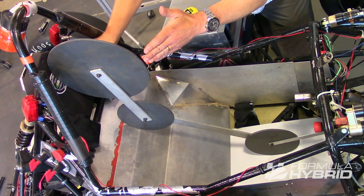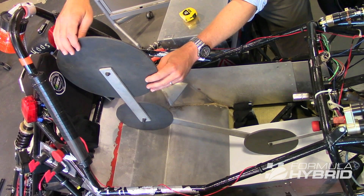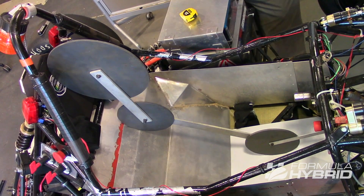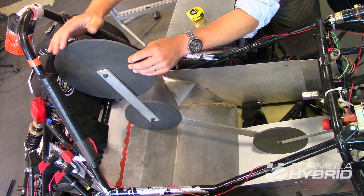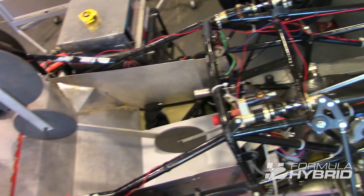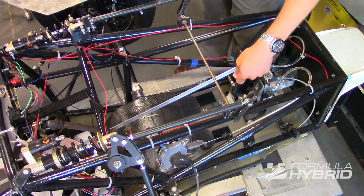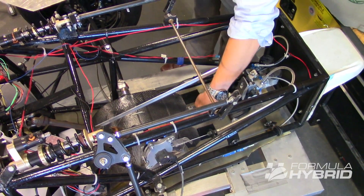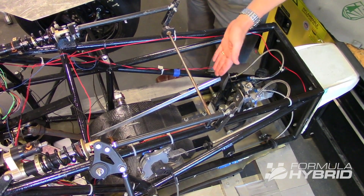PERCY's head sits against the headrest and can be up to one inch forward of the headrest, but no further than that. We will also look at the headrest and see that PERCY's head is at least two inches from all sides of the headrest. Moving forward to the feet, PERCY does have a foot, and therefore at 36 inches forward of PERCY's hip point, you have to have the foot elevated off of the floor and preferably sitting right on the rearmost pedal.